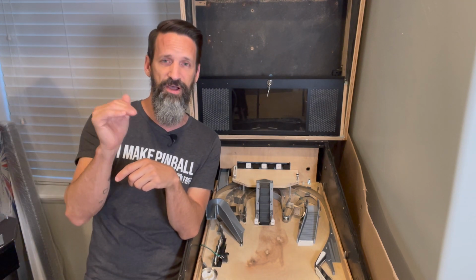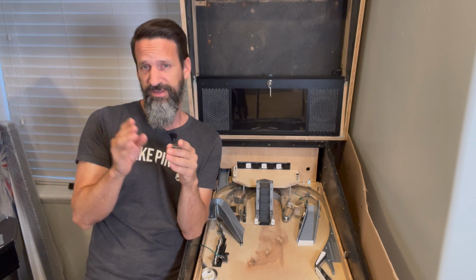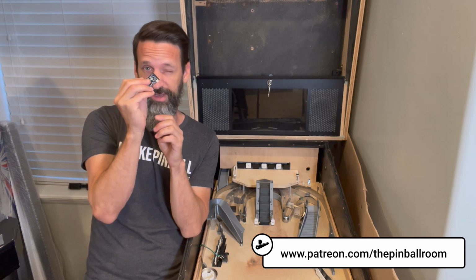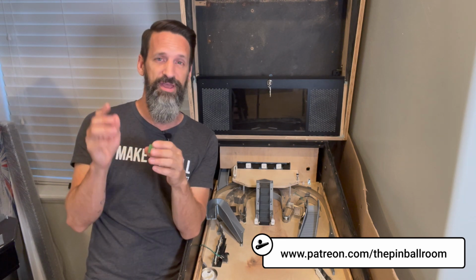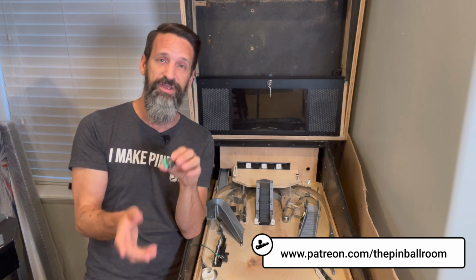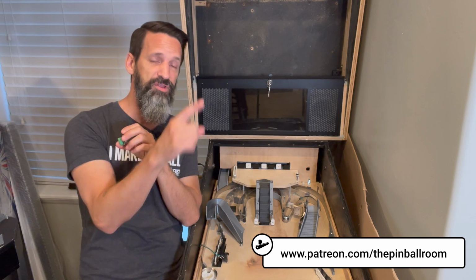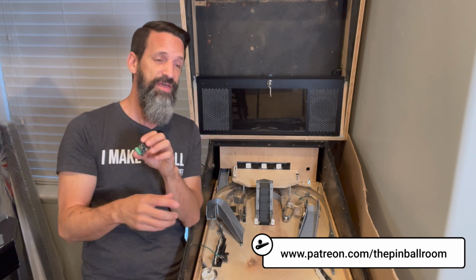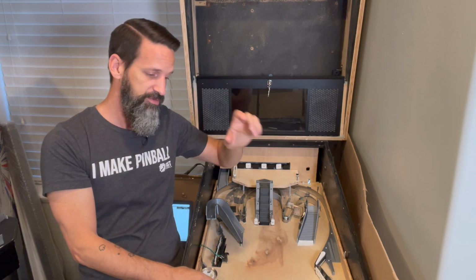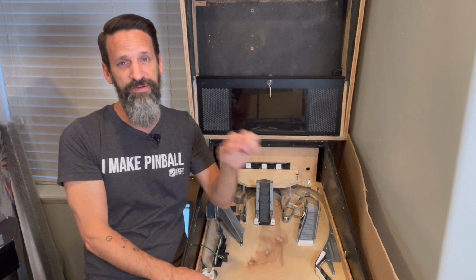Inside the main config file, define it as a hardware device, add a stepper section, define your stepper with a name, define the actual number, the ID of this control board. And then set up your homing mode as a switch. Define the switch that you're going to be using for that. Define the direction you want it to move during the beginning to get into position. And then go through and declare those named positions. What are the different turns that you want the stepper motor to do, and what events do you want to have firing that?